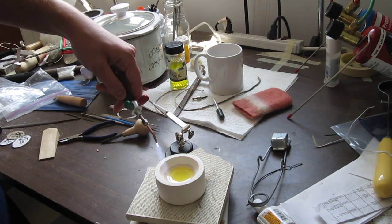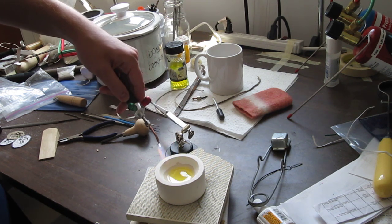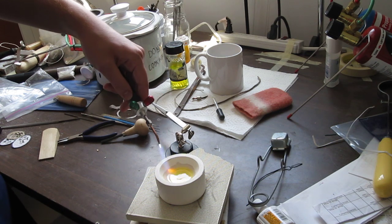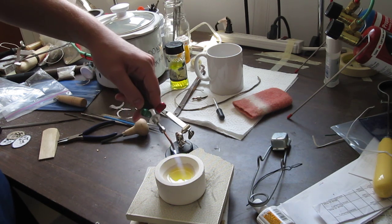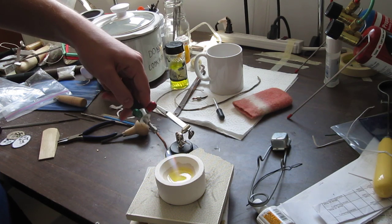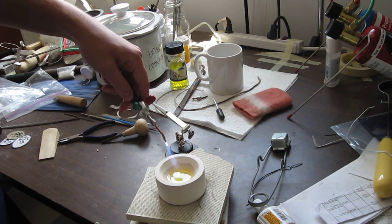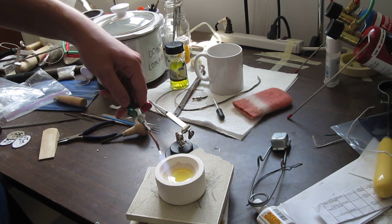Remember, the flux is made up of glass or glass-like material, so you definitely want to wear goggles as I am right now. When you do casting you'll also want to add more flux to clean the metal itself — this is just more to prep the crucible.